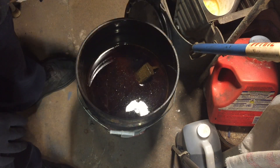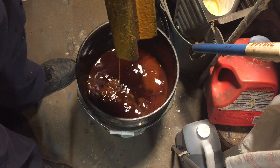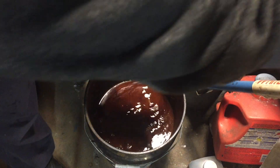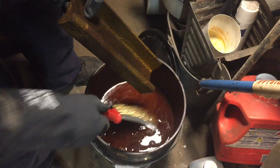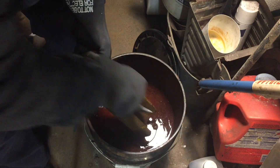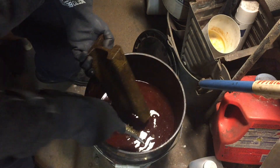Here is my two-year-old bucket of vinegar. It's not going to be big enough to cover the whole thing, but we'll get it in — it covers most of it. I'll flip it and leave it in there for a while, then brush it a little bit every eight hours or so. It's been ten hours — I tilted the bucket so the entire part was covered. Let's take a look. You can see the rust is starting to dissolve a little bit. We take a stiff brush and brush off some of the loose particles, then immerse it again for another eight to ten hours.